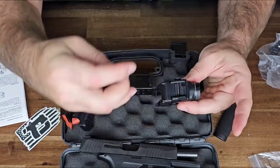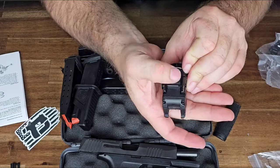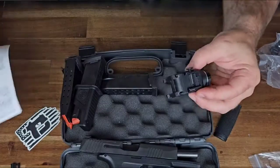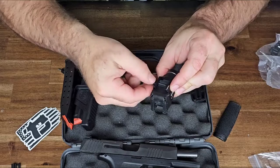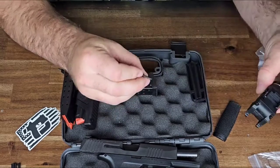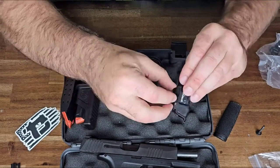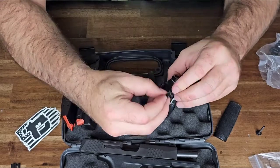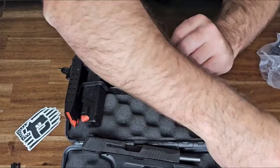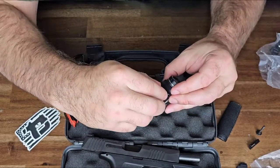With a little bit of movie magic, I have removed the 1913 style rail attachment system that came with the flashlight and replaced it with the Tactical Development X Macro attachment key — you can see right there it says X Macro. I tried following the instructions, but the easiest thing to do is just fully remove the tension bolt from the system. You don't want to lose the spring on the tension bolt — set that to the side. Then just remove the portion that attaches to the right side of your Picatinny rail system, and you can easily remove the actual key, which just slides right out.